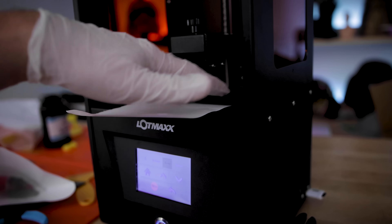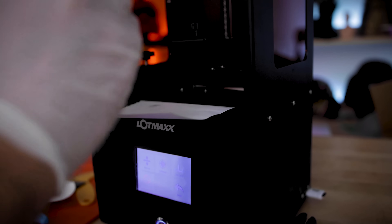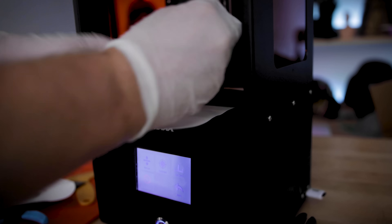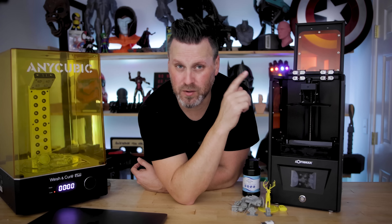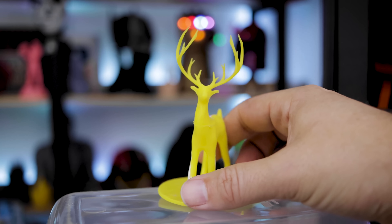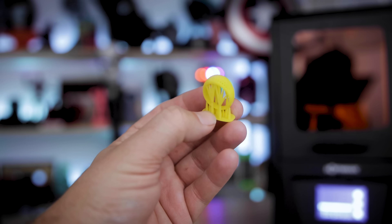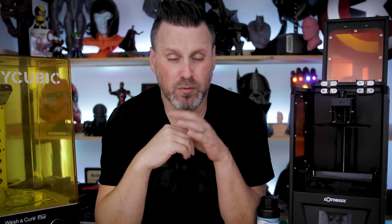The build plate leveling process was really easy. There are four bolts on the side of the build plate — you loosen those and level it. Where you'll run into difficulties is tightening those bolts inside the case; it was really hard to maneuver the Allen wrench in there. I did have one failed print because I went ahead and printed without leveling it at all, and then I had a few successful prints — like this deer, one of their test prints, as well as a test ring. But as soon as I tried to print anything else I had sliced, it didn't work properly until I leveled the build plate.